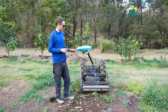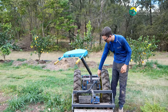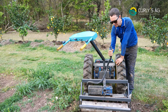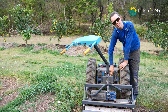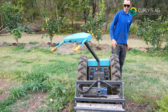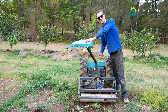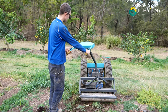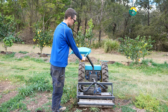Before removing and reattaching any implement, first thing is to turn it off. Second, unplug it — it's important that you unplug it, though our new connectors do pull out by themselves if accidentally left in. We've also got dust caps that must always stay on when not in use to stop dust getting into the connectors. Next, close up the counterbalance lid, then pull out the pin — leaning back on the handlebars takes a pinch off it and it comes straight out. Then drive away. If you didn't turn it off first, as soon as you disconnect the connector it'll start beeping at you.